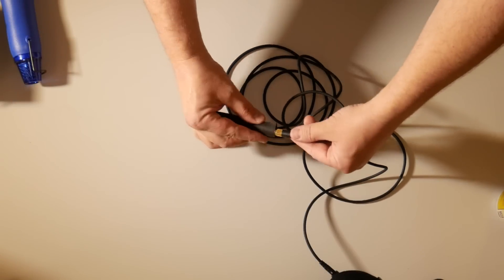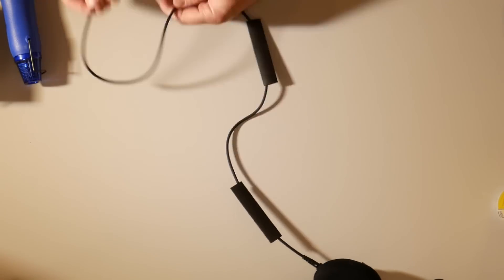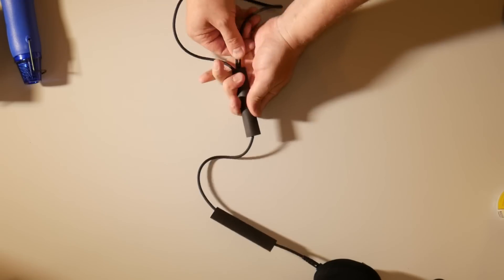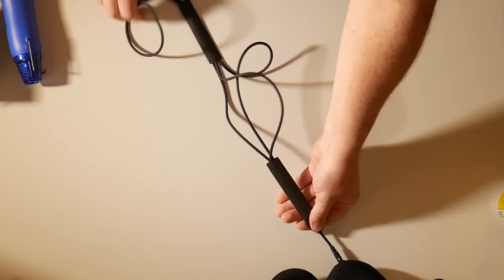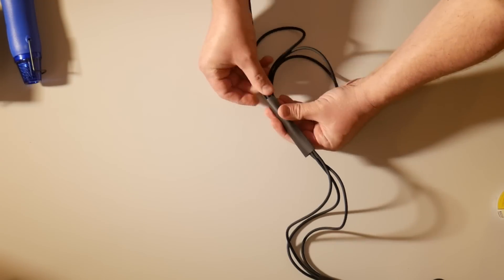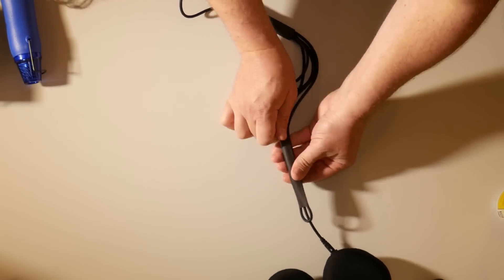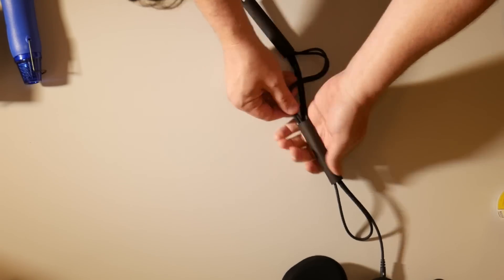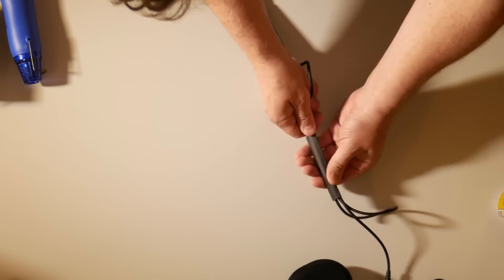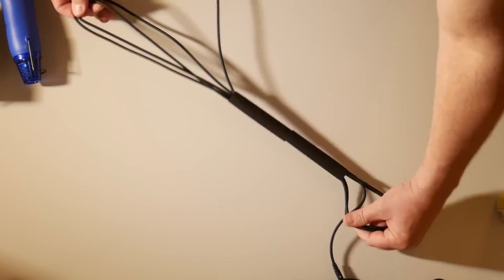Technique 4: Heat-Shrink Tubing. Start by putting at least two heat shrink tubes down the cable, unless you have an extra long piece. Using the same back-and-forth motion that you used on the braid, you can fold the cable upon itself as many times as you want, thus reducing the finished cable length by over five times. About heat shrink — there are two things to note. The first is that the shrink ratio corresponds to the amount the tube will shrink under heat. Most heat shrink tubing has a 2-to-1 ratio, which means it will shrink down to half the diameter, but there's also higher ratio heat shrink. A 3-to-1 ratio, 1-inch diameter tube will shrink down to one third of an inch, and a 4-to-1 ratio will shrink down to a quarter of an inch, and so forth.